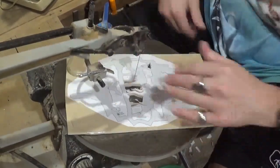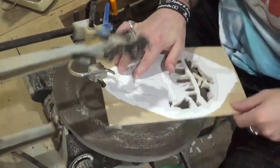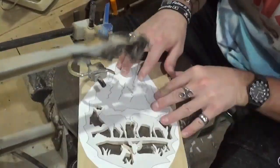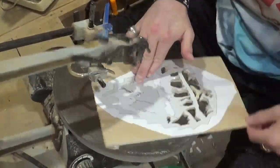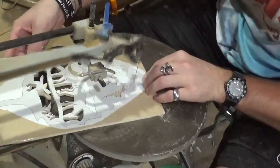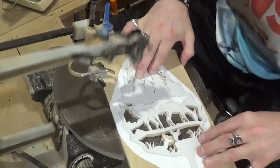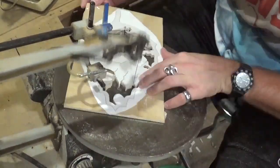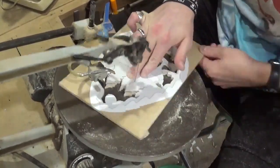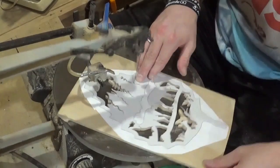As you can see, on some parts of the scrolling I'm just taking my blade in and bringing it back out without doing a full cut, and that is just the veining work that's in some scroll saw patterns. I think it just adds great detail to a project. When I get done with the actual cut, you will see me do some of the veining work between the trees — going in and then just backing the blade out. It just puts a line there, a nice visual and an added detail that really adds character.